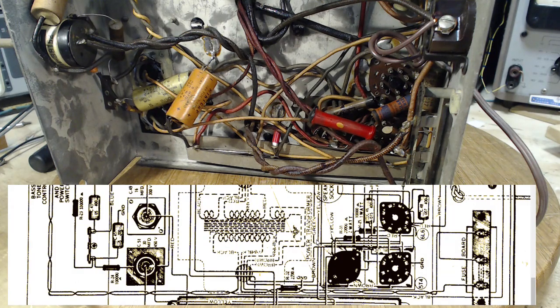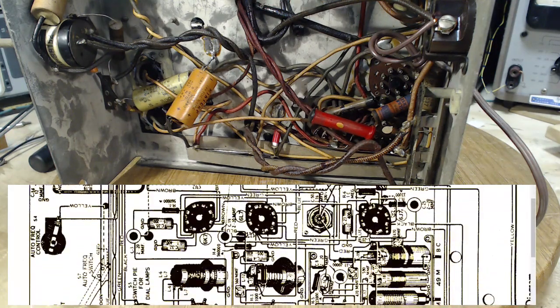I've been looking for something that doesn't exist. What really exists here is the plate circuit of the output tube passing through this connector — that would explain the red wire coming from the tube. With the speaker unplugged, the output tube is disabled too, because the plate circuit is interrupted.